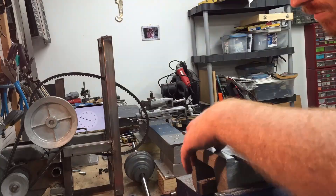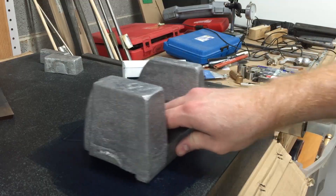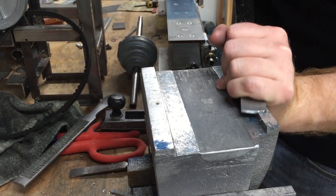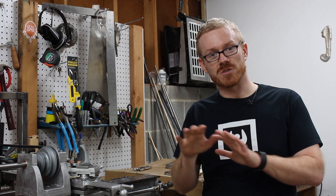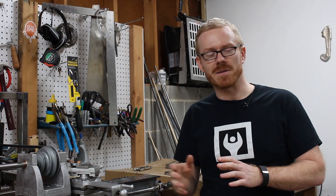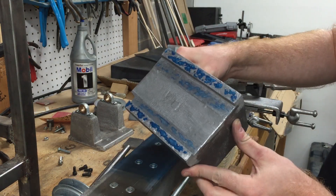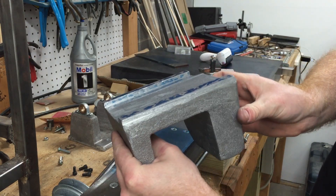In the second book of the series, David Gingery describes using emery cloth on a surface plate to allow you to quickly reduce a surface to roughly flat before scraping. I haven't tried that yet, but I think I'll try that on the tailstock videos. That was a question posed by Willem Cawson in part four of the series.